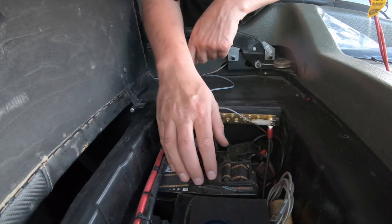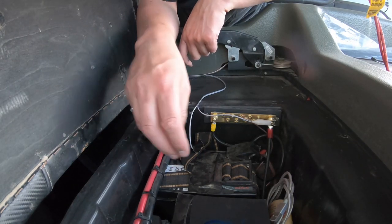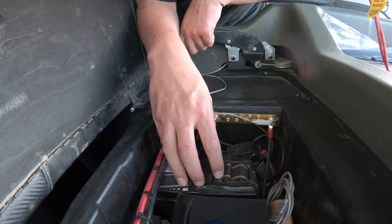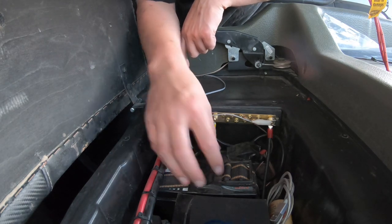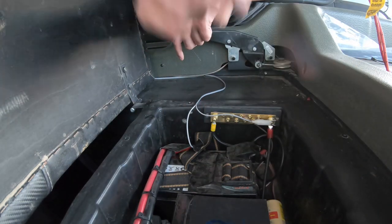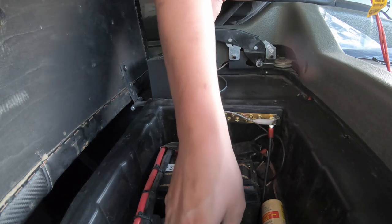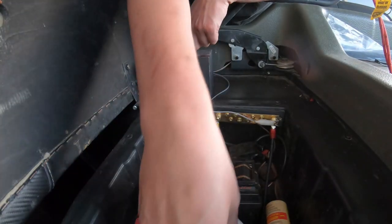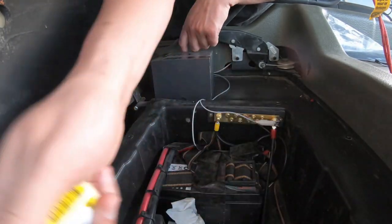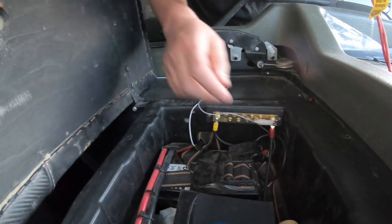The battery is a sealed lead acid deep cycle that is about the same capacity as the one that was in here, but half the physical size. It's a non-spillable type, which means if I roll it over or bump, I'm not going to have acid splashing around everywhere in here. Secondly, it leaves room in here for my life jacket, a roll of toilet paper, and a survival kit. All things I think are very handy, along with some bug spray. A little tin of this stuff, magic.